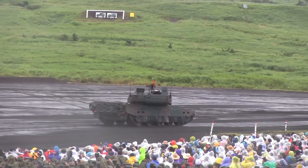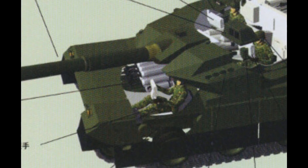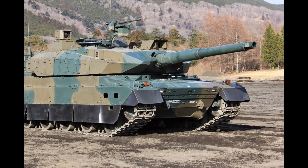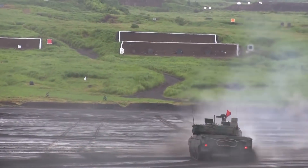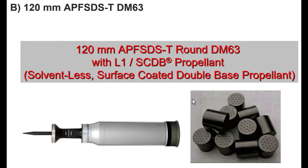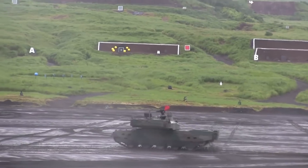The next problem is the protection of the hull ammunition storage. The bustle autoloader has only 14 rounds in it, which is a problem on its own, but the remaining 21 rounds are stored in the forward hull compartment next to the driver. This can lead to the catastrophic loss of a tank if the ammunition in this rack is hit. The lower front plate has no additional protection, which can also be a problem, though that area is least likely to be hit. One redeeming factor could be the ammunition propellant — Germany switched to a propellant that does not catch fire when hit by hollow charge munitions, but I could not find any information on whether Japan adopted something similar.